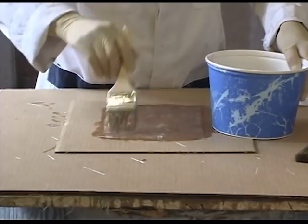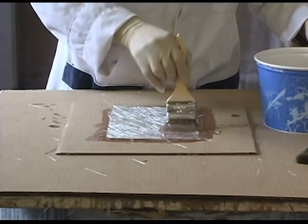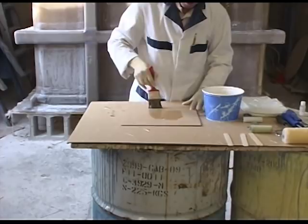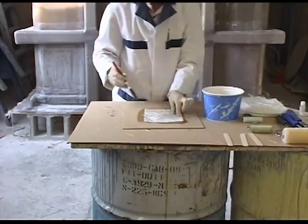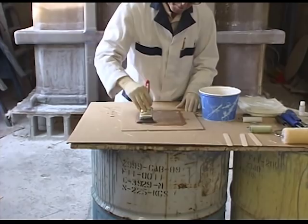For an average repair job, such as fixing the inside of a fender, this would be a process that you would use to get a good laminate. Little bits of air bubbles are tolerable, and you'll get good adhesion. Now we're using the Go brush, and Bernie's going through the same process here again of pre-wetting out a board, taking the resin. You'll notice with this brush, it holds a lot more resin and it makes it really good for doing a real quick laminate.